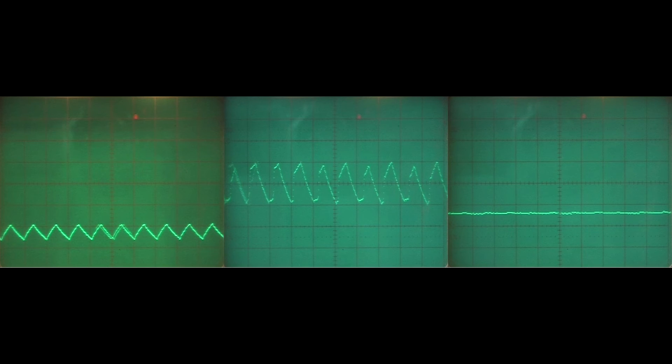On the left we have the 100 watt incandescent light bulb running on the modified AC output. In the middle we have the 100 watt bulb plus the 150 watt metal halide on the modified AC output. On the right we have the metal halide lamp running on the DC output. If we add lines to the traces indicating the average current, you can see that the metal halide in both cases — whether AC or DC — pulls about 12 or 13 amps. Is there a benefit in running it on DC? Possibly in terms of wear and tear, especially with this awful inverter, but in terms of energy efficiency, probably not a lot — unless that sawtooth waveform has an adverse effect on the battery or the power supply. So now you know.